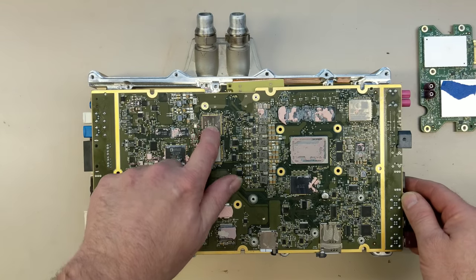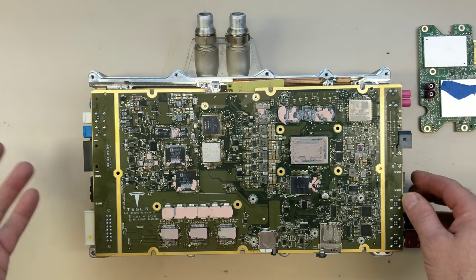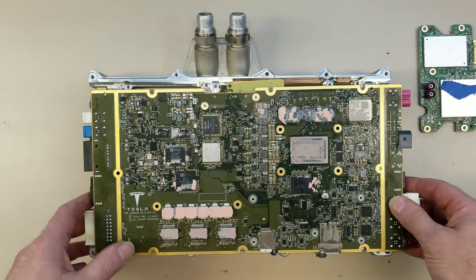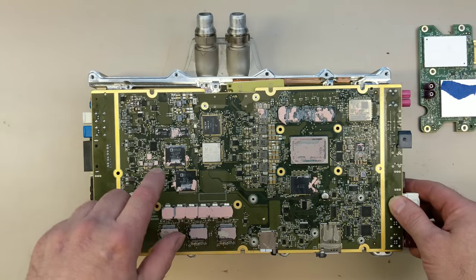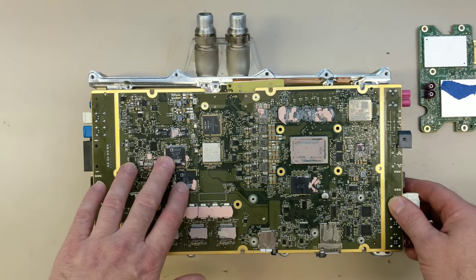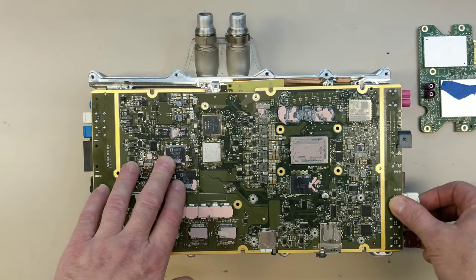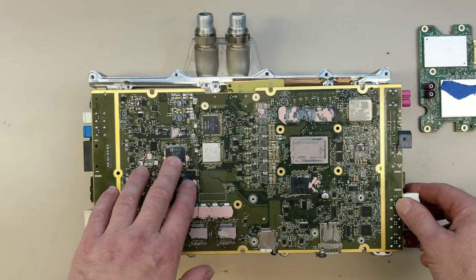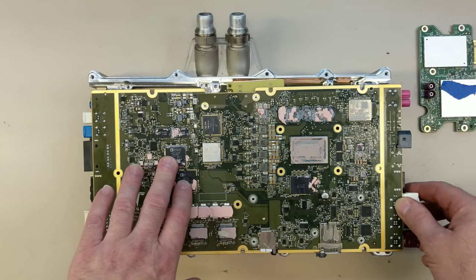This is the gateway — really the same one being used in Model 3 and Y. It's a PowerPC processor, automotive grade; I'll put the part number in the description. We've got not one but two different DSPs, whereas on the Model 3 we only have one. This extra DSP grunt is probably for the active noise cancellation that's being introduced — it isn't yet active.